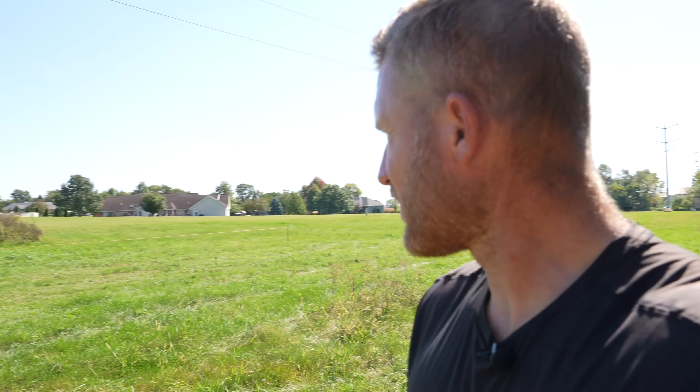The point of all this is I'm just trying to get a good feel for where I want the top of floor to be. That's something I need to determine for my concrete guy. That's all going to be based on the elevation here because I don't want water to run down this hill and come into my building. But also it's a fine line because I don't want to go too high, because then it pushes the back of the building out of the ground as well, which means more fill, more gravel. But I do want to make sure I can maintain some good watershed coming off where my drive is going to be.